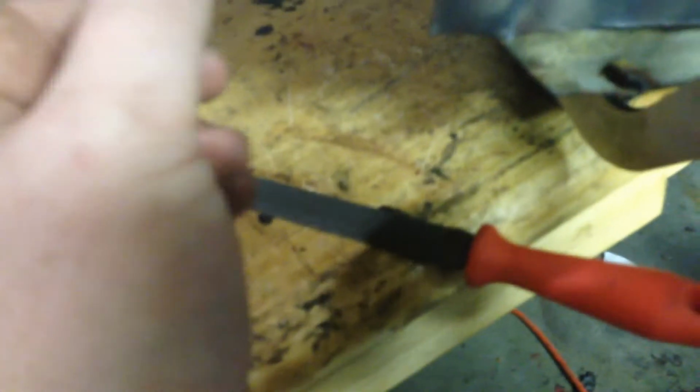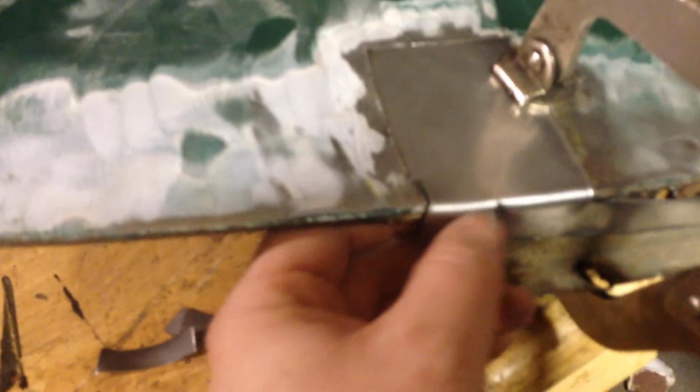Okay, patch is made, well, almost made. I'm going to roll this little bit up. It's got the rolled bead on the wings here, so I'm going to try and roll that around. I've got a little extra tail in here, you might be able to see, just for fixing the very, very bottom. There's just a tiny little ugly spot I cut out in there, but otherwise, patch is made.